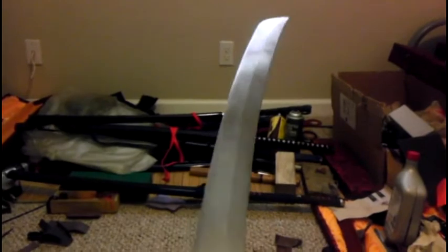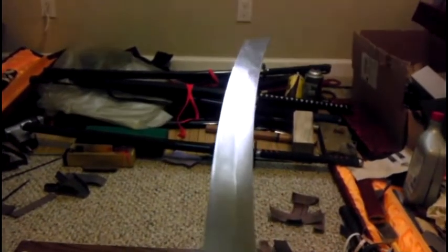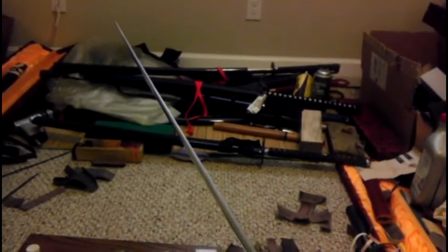This thing has actually got a lot of niku. Actually, quite a bit of niku on the thing. The design on this one, you can see how wide the top of the shinogi is. Basically, what we want is a more rigid blade for hard targets. We don't want to thicken it so much that it'll be heavy, but we want to add niku on the blade.